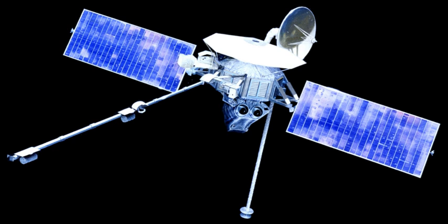The spacecraft's electronics were intricate and complex, containing over 32,000 pieces of circuitry, of which resistors, capacitors, diodes, microcircuits, and transistors were the most common devices. Commands for the instruments could be stored on Mariner 10's computer, but were limited to 512 words. The rest had to be broadcast by the mission sequence working group from Earth.